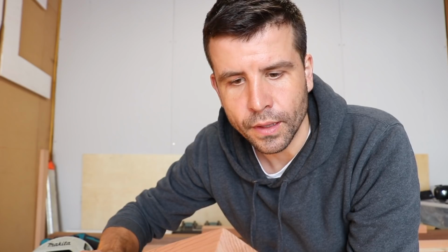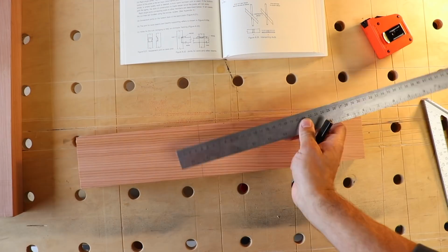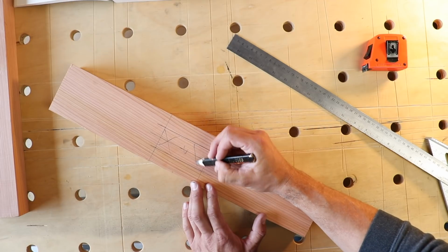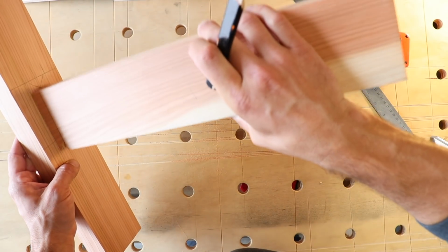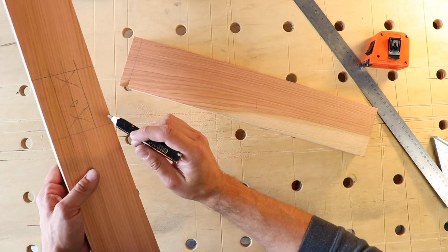That's the first part. Now let's see how it cuts into the post. That part there, you know, I need to take out the full sides of the timber, which is fine. But then once it's in, it wants to go down. So I need to make a 45-degree cut inside. I'm going to cheat a little bit.